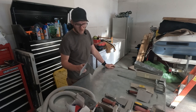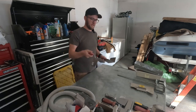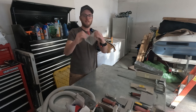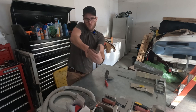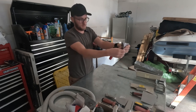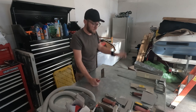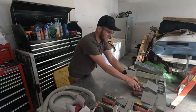Another tool I don't have much success with — this is the same idea as the inside corner trowel, except one is an innie and one is an outie. The outside corner trowel: I get the principle but I don't like it. Because this is pre-shaped, it's not a 90 — you force it to the shape you want. You've got so much force on these edges that it just sweeps all the mud off the outside corner and catches the paper on your corner bead. For me, it just mucks up the whole operation. Why is it in here? I don't know, but they're a family so we're keeping them together.